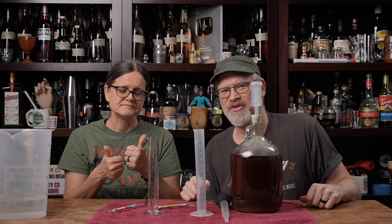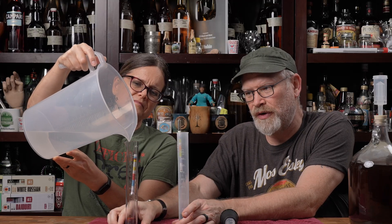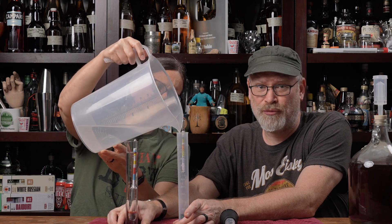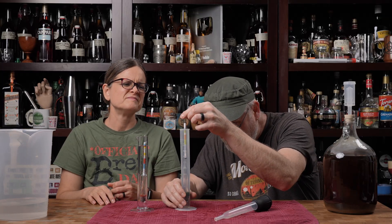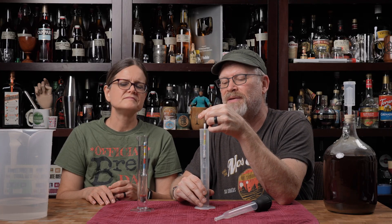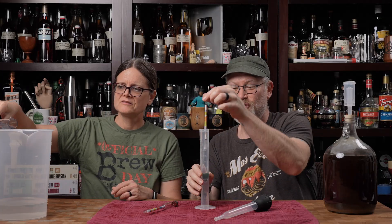First thing I want to do is test the accuracy, so we're going to take some water. When you're measuring water with a hydrometer, unless you're using distilled water at the exact correct temperature, you're probably not going to be at exactly 1.000, but you should be right around there — within a couple of points. Our old one is calibrated at 60 degrees. I know this water is probably more like 70 or 72 degrees, but it is reading right at 1.000. The new hydrometer is calibrated at 68 degrees, a little different, but it is also reading 1.000. We had an earlier model that was pretty far off calibration, so it's really cool to see the new one is accurate.